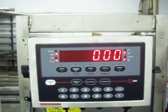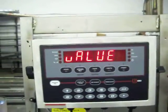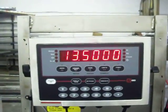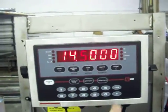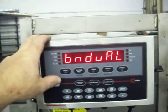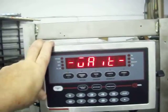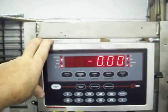If I want to change set point 2, hit the set point key two times. It'll scan through and show the current value for set point 2. Right now we're sitting at 13.5 kg. We'll change that to 14.0. Press the enter key. It'll show you the BNDVAL band value. We don't change it. Just press the up key twice. It'll show weight and go back to its normal value.